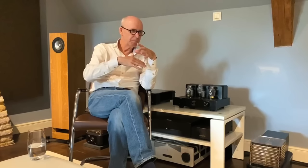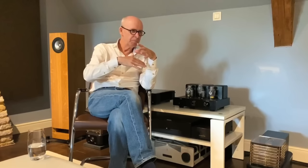In the beginning Class AB wasn't that successful. Early transistor amps had issues — though the Quad 303 ran for an enormous number of years, still in production in the late 80s having been invented in the late 60s. The problem was that when switching from the positive to the negative half cycle, you could get distortion at that crossover point. When an AB amplifier distorts it doesn't sound nice — it tends to grate. If you listen to an amplifier and it sounds too harsh and you always want to turn it down, it could be a cheap or malfunctioning AB amplifier.